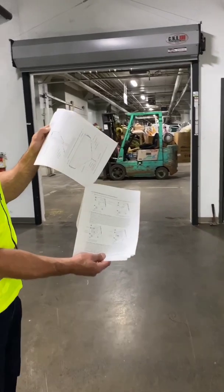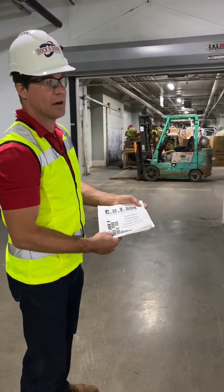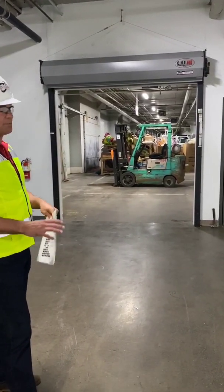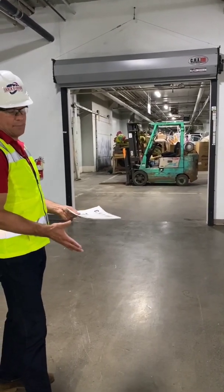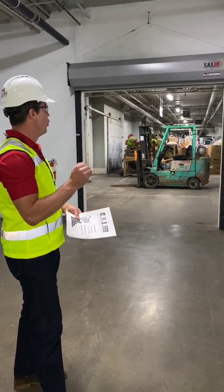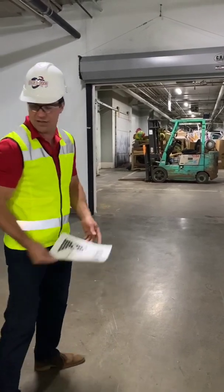It shows how to drop test it and, most importantly, how to reset it. If you don't reset it properly, it's not going to be ready to go if there is a fire. The process here: step one is to do an inspection on the door and everything involved with it, including the fusible links. Step two is an operation check — those two do overlap. Then step three is the actual drop test itself, done twice: once to make sure the door is right, and a second time to double-check your setup and make sure you're resetting the door properly with proper tension.